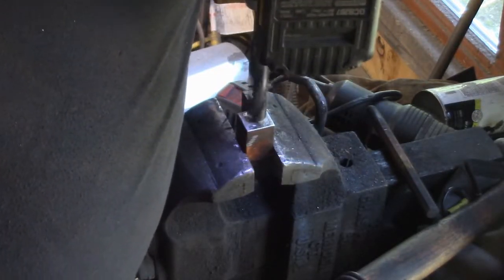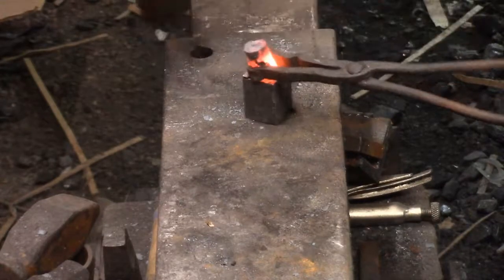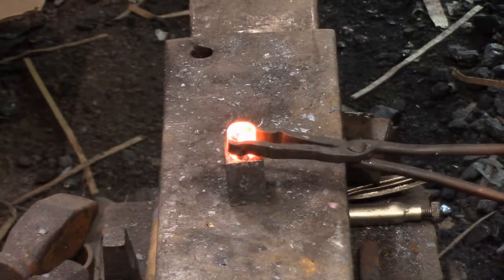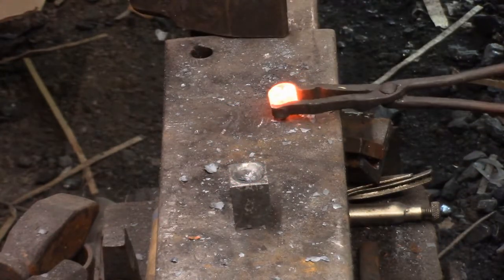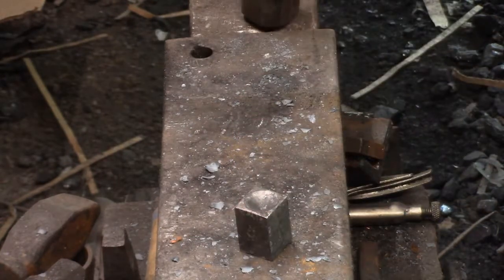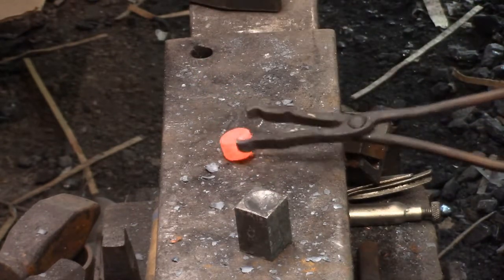That is 1-inch square stock, and I think there we are, after going to the drill press. So same thing, I'm going to upset the end, but I'm going to use this nice little die here. And that should give it more of a shape that I want, with less grinding. Because after all, the object is to grind as minimal as possible. So I know that it works.